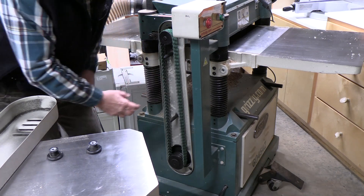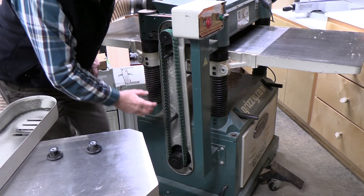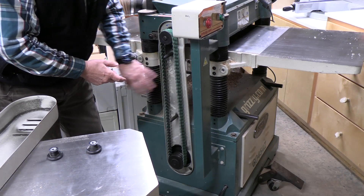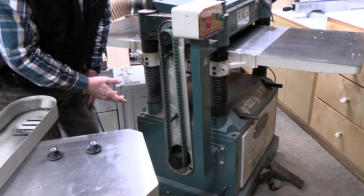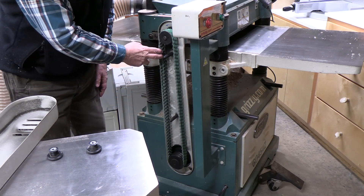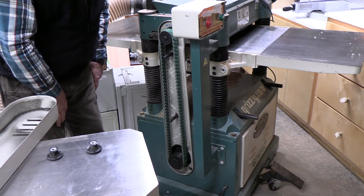There's usually enough play with the motor on the motor mounts to change the position of the drive pulley, which is down here, with respect to the belts. We'll take a look inside the base to see how much give there is. If there's not that much give, we'll loosen that up, take a few links out of these link belts, and then tighten it back up.